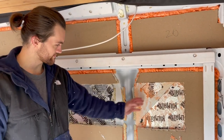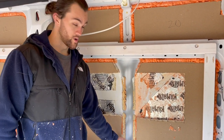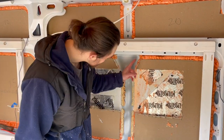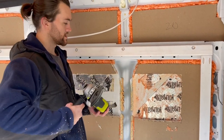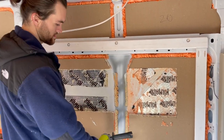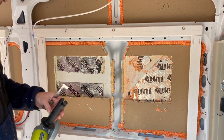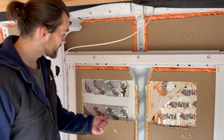We got the strut off and got some insulation cut around it. My original plan was to not have to use the grinder — I was going to try and just pry off the weld points, but it didn't work. So we used our angle grinder with a thin metal blade, hit all four joints, and pulled it off, just like we showed in our bed recessed video. Then we traced out the framing of the window.